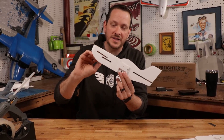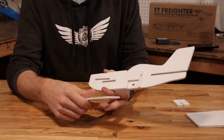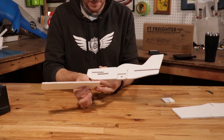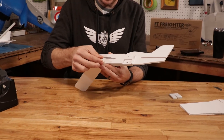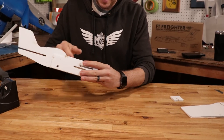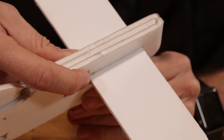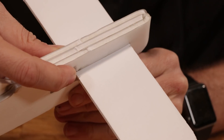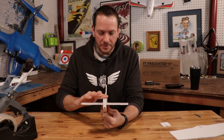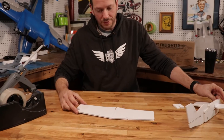That's why this airplane is so incredibly stable. Our next step is to install our fore wing. You'll see there's a higher radius on the front edge — that will be the front side. I like to pinch it just a little bit and roll the two pieces together so it passes through without snagging. On the back side, I'll use my fingers to support the fuselage as I pass it through. You'll notice two little hatch marks in the middle — we want to pass this through until it lines up there. If you lined up your doubler properly, this will be nice and perpendicular to the side of the fuselage.